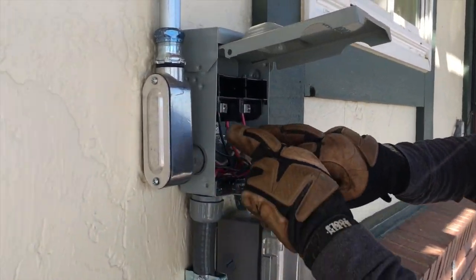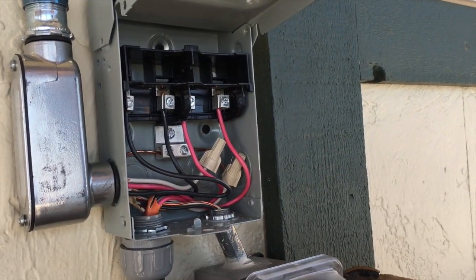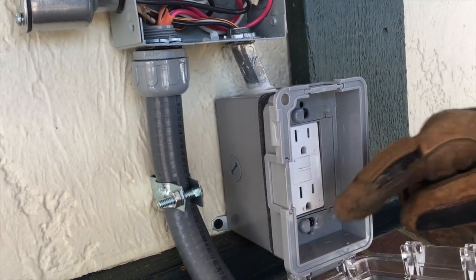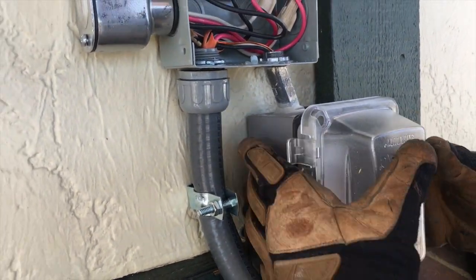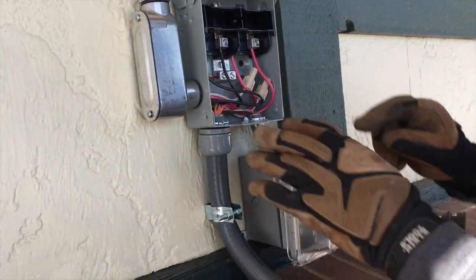As we came in here, you have to notice you've got your line versus your load. We also wired in for this outlet right here — it's a WR (wet-rated) GFCI TR plug with an in-use cover and a bell box that's sealed. All of this came in and terminated separately, and they'll come in and install the unit later.